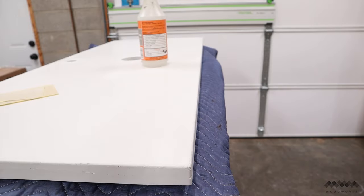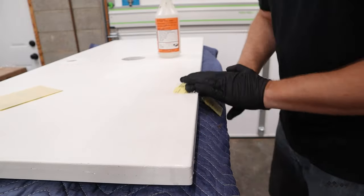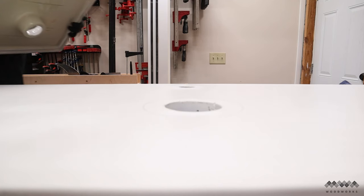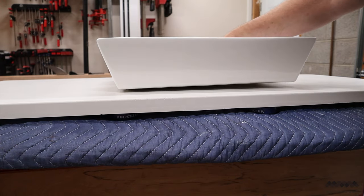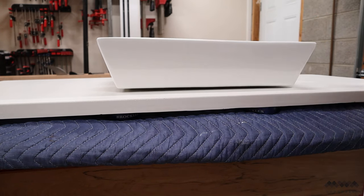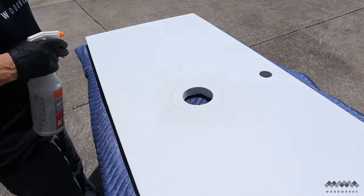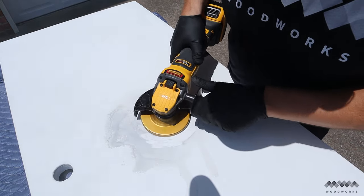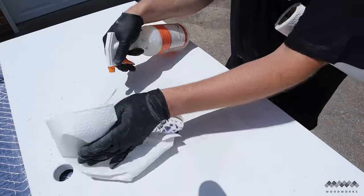On the top edge, I take a lighter approach and use 320 grit sandpaper with water as a lubricant, done by hand, just to clean up any small lines or imperfections left by the silicone. One problem I knew I'd have to deal with was the vessel sink, which has a slight convex surface on the bottom and doesn't sit flat on the vanity top. So I used a diamond cup wheel on my grinder to create a relief around the drain hole about six inches in diameter. The diamond wheel did a great job, and in a matter of minutes I had it dished out.